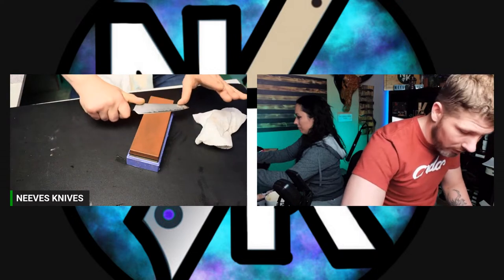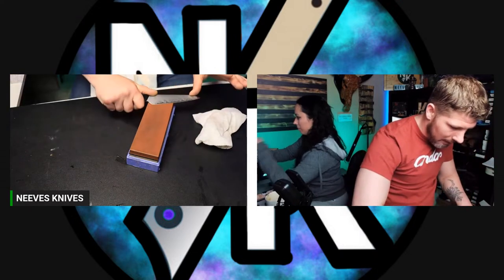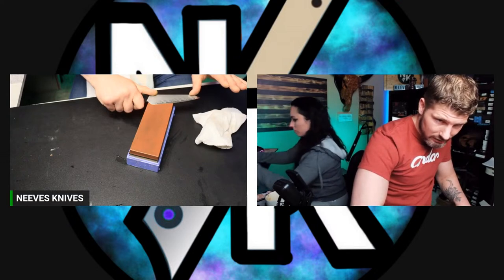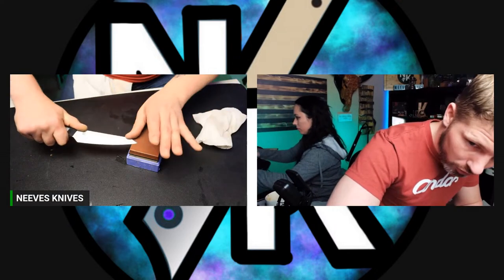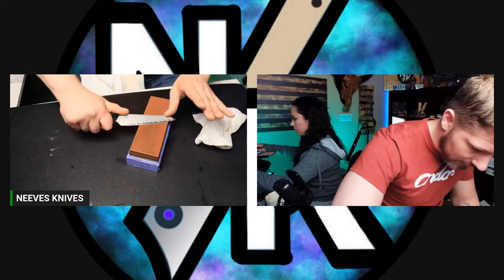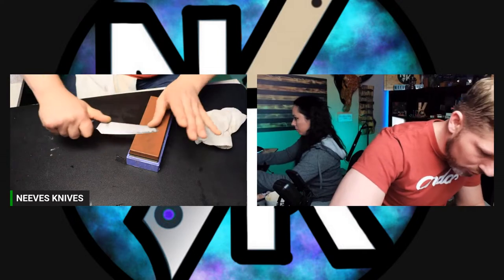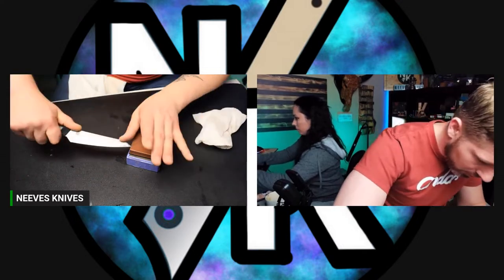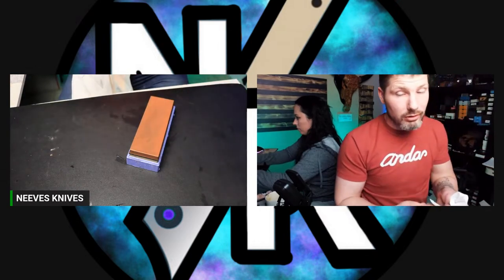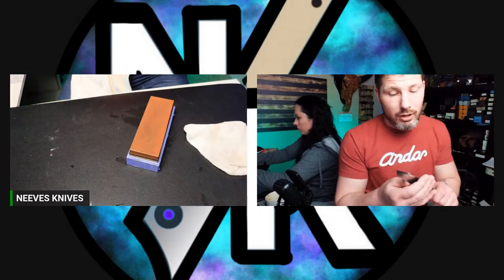And you notice I'm kind of going at an angle. I'm just rocking my whole body. My wrist is locked, and I'm using my body to go across the stone, and then I'm lifting my elbow at the last second. So I'm not even using my elbow to go across the stone. I'm using my body right now. This is a great way to hold your angle and make sure you don't veer off. Okay, we have a good burr.